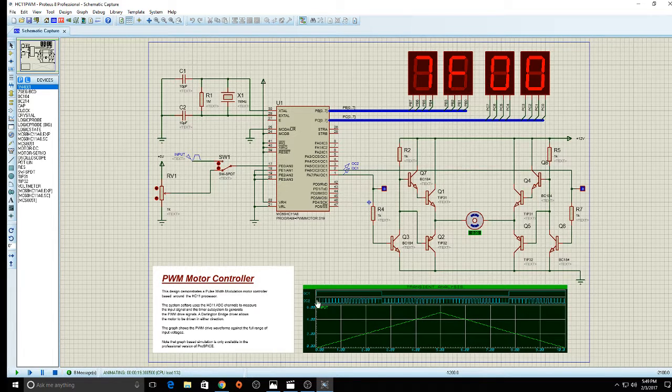The microchip takes over and says, 'I want you on for this period of time, this period of time,' and gives longer and longer pulses until the motor gets up to speed. Then it turns off the electricity and keeps pulsing — pulse, pulse, pulse, forward and reverse in this demonstration. In our case it would just continue to pulse until it's on, and oscillator one would actually turn the power off in increments while pulsing, so you don't get that inrush current.